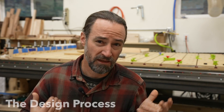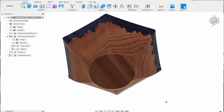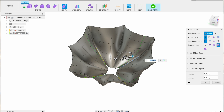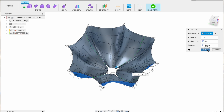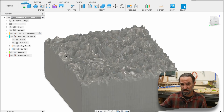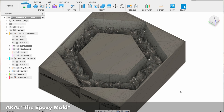While I wait for the glue to dry, let me talk about the design process. I wanted a curvy feel to the bowl and designed the basic shape using Fusion 360's form tool. This uses T-splines to manipulate the model, and I did a six-sided mirror to create the basic bowl shape. I modify a flat surface into the bowl shape and then apply a thicken command to give it thickness. I create a bumpy cube shape in Blender and import it into Fusion 360, then do a bunch of clever merging and cutting to create what I call a drip stock — really just the mountainous terrain that I start out with.